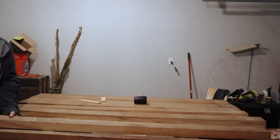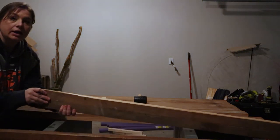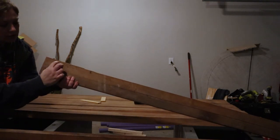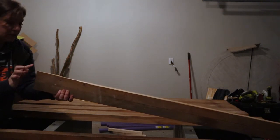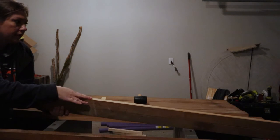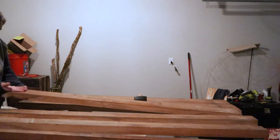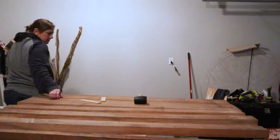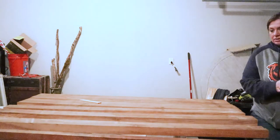One reason we're going to do it this way instead of just pulling them and forcing them apart is that you can see here that this — I split apart. This is the actual seam right here, and this is where the wood just kind of gave up. So we're going to have to figure out a different way to re-adhere this piece to that piece so we can glue them together, or start the biscuits down a little bit further. This looks pretty good — the seams aren't very bad. So we'll probably just keep that together, and if it does come unglued we can re-glue it. Just the ones that have big gaps that really need to see better days.